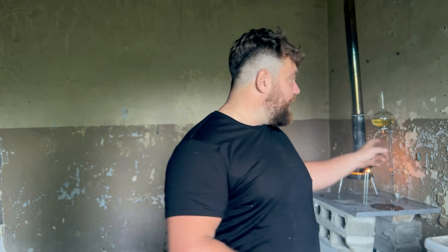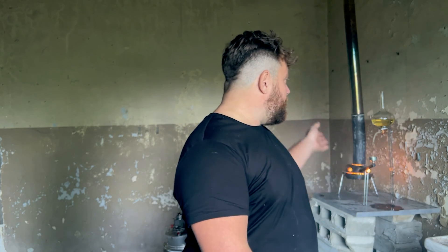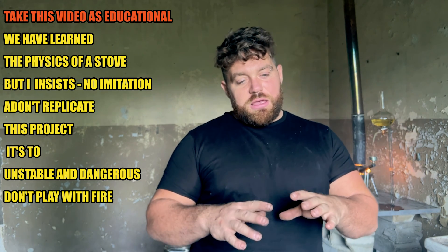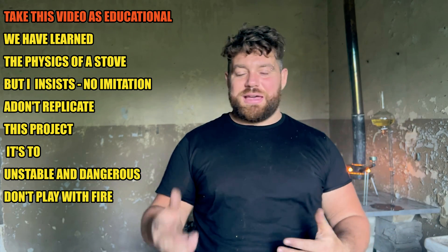But I really think that this is dangerous. Even if we see on YouTube — especially in Asian and Russian YouTube — stoves like this used daily to cook and heat up the house, I think it's very dangerous. Little things can go wrong: for example, the regulator of the oil flow can malfunction and push more oil. Also the exhaust can be blocked so the fire doesn't burn efficiently and then the whole house will be covered with smoke — it's a terrible thing. So this can be very dangerous. I want to share with you the tutorial process of this build in any case, because maybe somebody can see if I made mistakes and suggest in the comments how to improve the project.